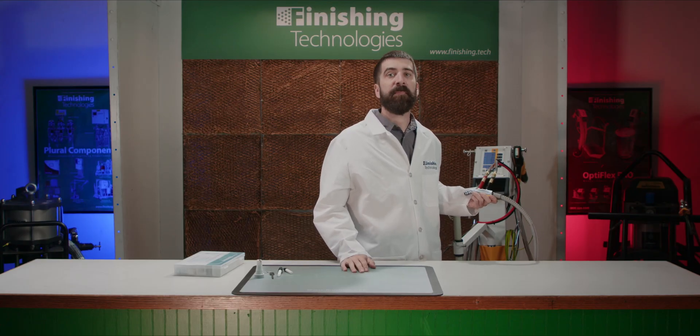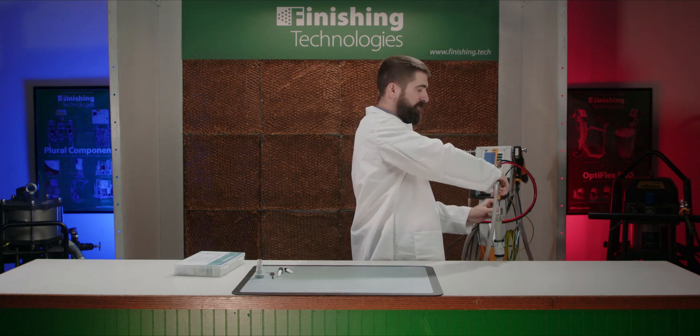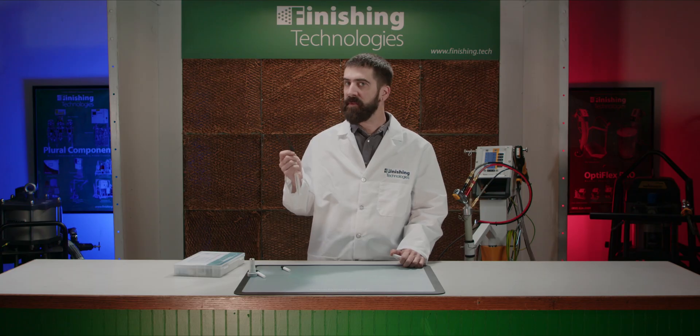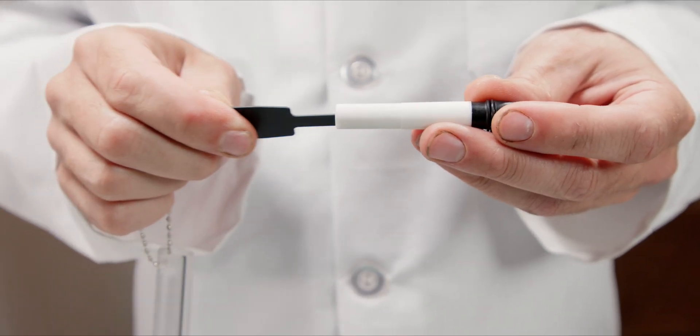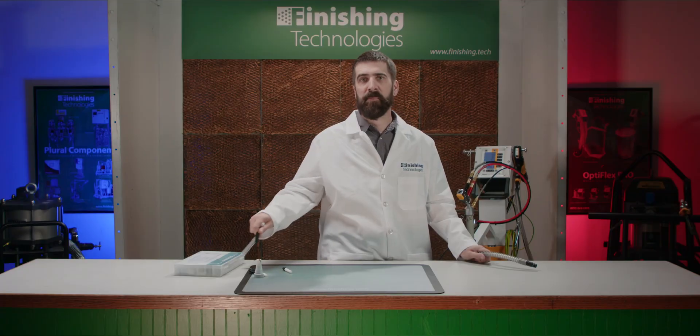At the heart of this system is the powder pump insert. This PTFE insert is designed to last for around a month if you're spraying powder Monday through Friday for eight hours a day, depending on the type of powder you're spraying. This insert helps maintain a consistent supply of powder through your system, and a worn out insert usually means you need to unnecessarily ramp up your air settings to do the same amount of work. If you can't tell visually how worn out your sleeve has become, use the wear gauge tool — one came with your unit or we sell them separately. If the insert is worn out, the gauge will insert all the way up to the shoulder. With a fresh insert, you should see about an inch left on the tool. A lot of shops will preventatively replace these monthly.